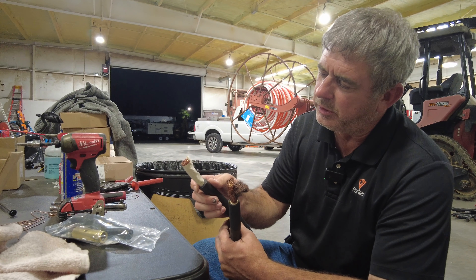And there we go — we got a brand new connector. Once you get to that point, your connector's complete. The male connector is very similar to the female connector. These connectors confuse a lot of people — what would typically look like the male connector is actually the female side. A little trick: keep up with the electrical connection, not the physical appearance of the cable. As you can see, the inside metal parts are female, so this is a female 400-amp cam connector. It's used in television, movies, studio, and portable cable applications — it's the cable connector of choice because you can change phase, change rotation, and do all kinds of things with the flexibility of the 400-amp cam connector.